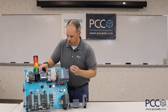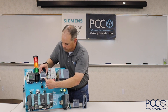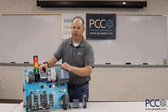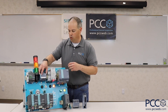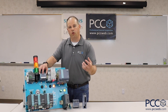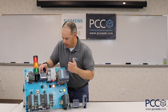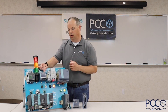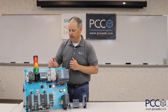Some other features: there are overload dials for monitoring the output current of each circuit. There are also DIP switches so that we can offset the startup of these individual circuits — we can offset the power-up so that we don't get too much of a high inrush as the complete circuit powers up. And we also have diagnostic status contacts that we can wire back to a PLC, stack lights, or whatever you might need.